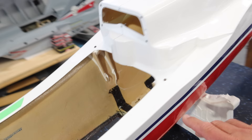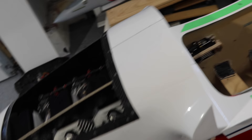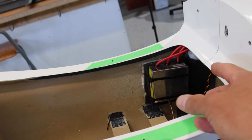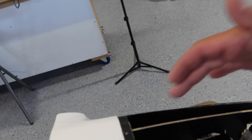I'm actually kind of happy I waited on this aircraft to put everything in place - initially I was talking about putting our electronics here, but I'm glad I put it all on the top side so we've got good airflow through the aircraft for cooling purposes on this engine. Tank mount is done. The other thing I had to do was turn the ignition around - reason being we've got our four or five wire connector here that needs to go to the RPM sensor which is right here coming to the front of the engine. This is a very short lead. With that ignition box rotated 90 degrees, there was no way this line would reach. Our spark plug wires are just long enough, so that all works fine.